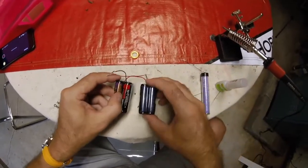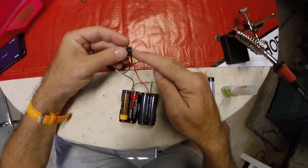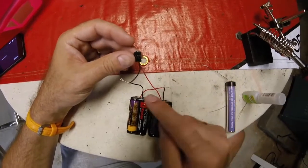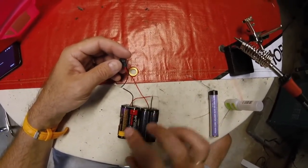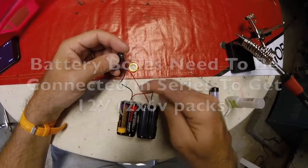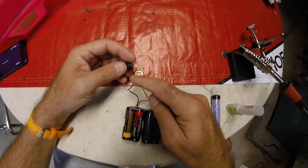I've got some super glue — in a second I'm just going to glue the two battery boxes together. But first, the important bit: the wiring. Each of these battery boxes has a connector. To get to 12 volts you're going to need to put the two boxes in series. So you go positive to negative — one positive lead going up to that — and I've spliced the other one in up to there.